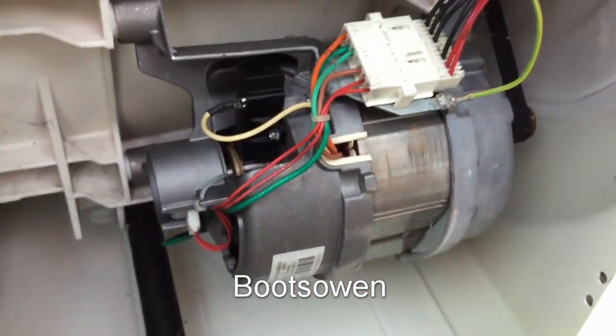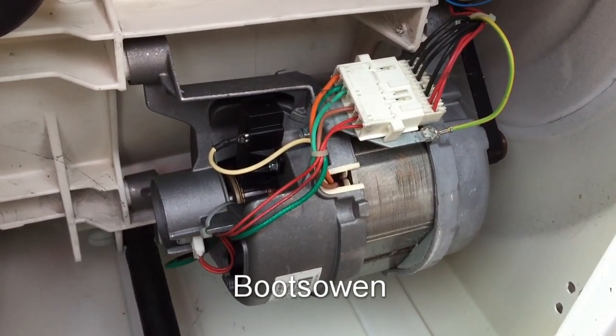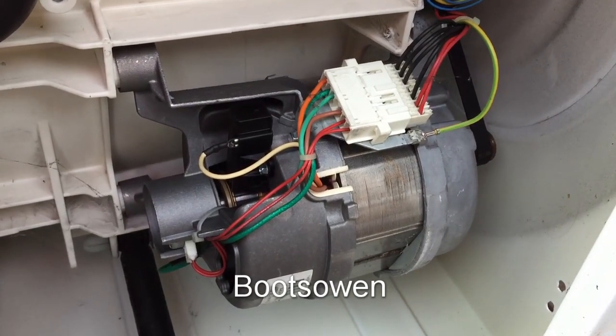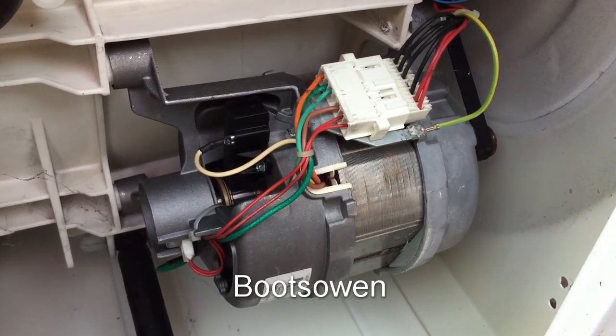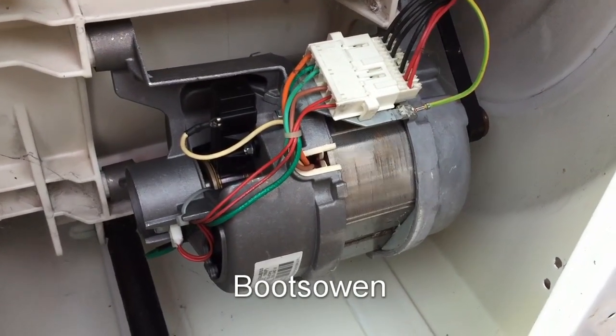What we've got to do is wire it in series: we've got to have the electricity coming into either a brush or a coil, then jumping from the other end of that brush or coil to the opposite, and then out again. So let's get that done and try and make sense of it all.